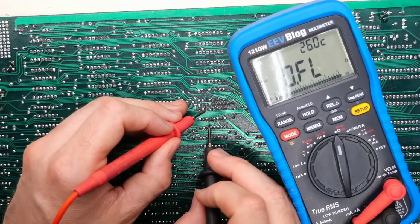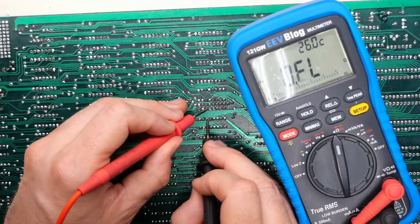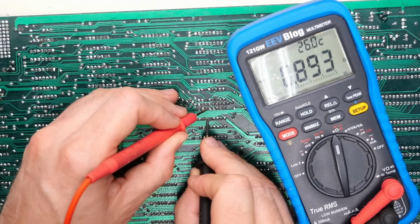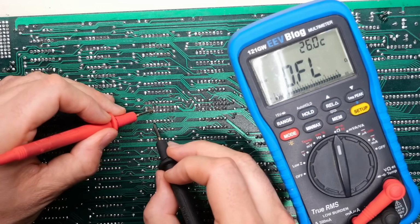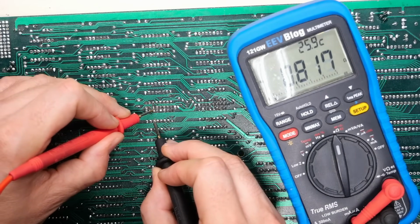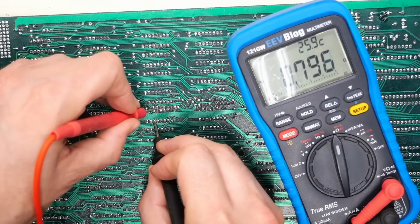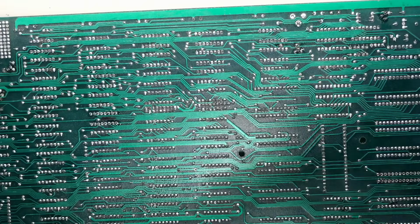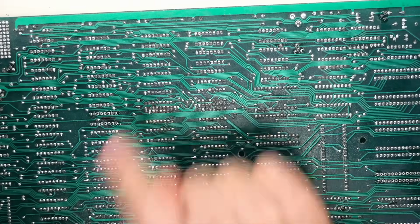And then let's check the third chip here. This is the bank 3. Look, 0.89 as well. So the problem has to be under this chip right here. That's what I'm thinking, because it goes down into the 0.7s. Oh, so I took that socket off for no reason. Okay. Let me remove this socket now.